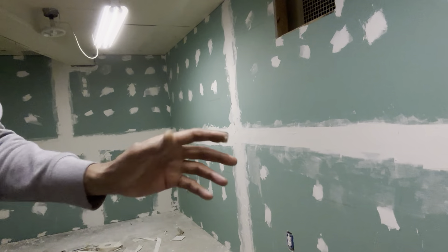Even the things I'm going to correct — like over here you can see a little unevenness. All you have to do, if there's a bubble under there, you can just cut that out and re-tape over it. Or you can just take this off, smooth it back down to the drywall, and redo it. It's not crazy and it's not an expensive fix. The main thing you want to do is when you put your tape on, make sure the mud you're laying it on has some moisture there so it actually sticks, lays flat, and you're good to go.